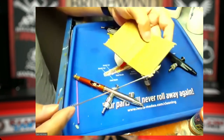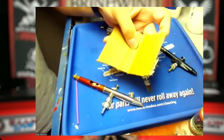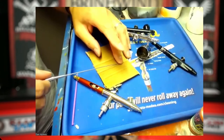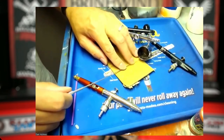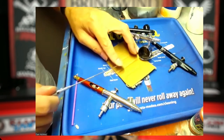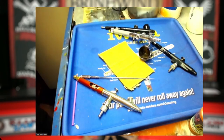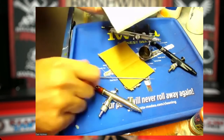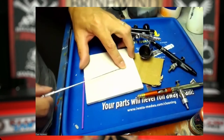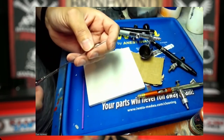There are a couple of different ways of fixing a bent needle tip, and it's going to happen, so just expect it. If it just needs a little polishing, take a piece of corrugated cardboard from a shipping container and bend it on one of the corrugations to get a fairly straight line. Hold the needle at the taper end so it tilts up slightly, then drag it while spinning on that cardboard. Just polish it back and forth gently and away you go.